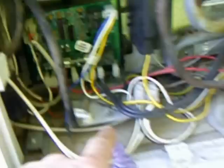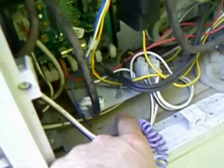So the next thing I did was take one of the heater leads — remember, both leads are disconnected — and measured resistance from that lead to ground, which is this aluminum grounding plane right here. I measured resistance from ground to one of the disconnected heater leads and got around 20 megaohms. That is not an indication of a short to ground. At 20 megaohms, the current flowing would be in the microamp range — it just wouldn't have made any difference. In the end, I don't think that had anything to do with this problem.